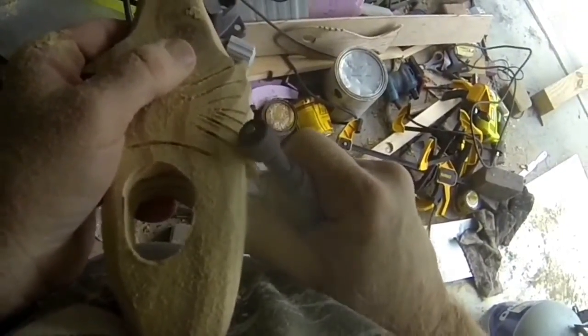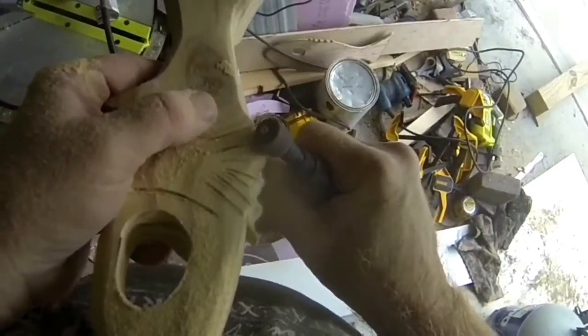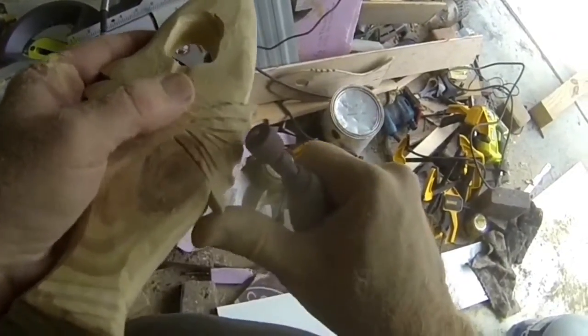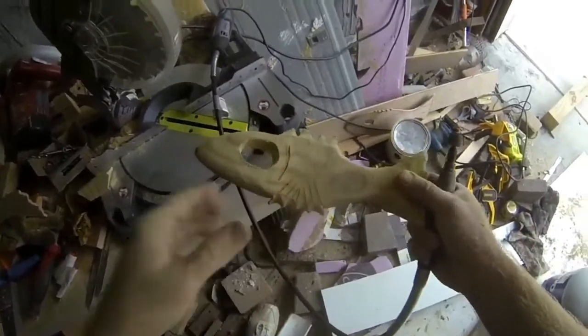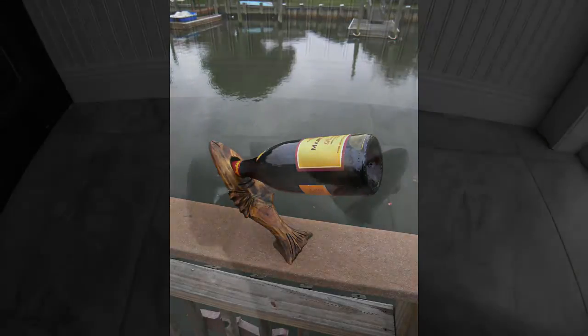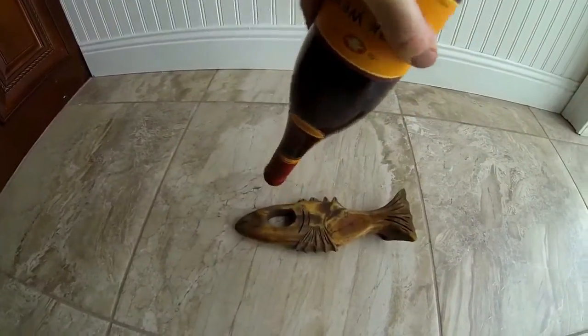With the Dremel I'm going to change bits — this is a drum sander — and I'm going to use that to add the little curves at the bottom of the fin. This is also a great little sanding tool for rounding out edges and adding contrast on the fins. You can almost carve quite a bit with this drum sanding disc. Once the fish is to the desired shape and you've got all the additional lines added, all you need to do to finish it up is a final sanding, add some stain and some polyurethane. And it's as easy as that — a nautical fish wine bottle bracket.